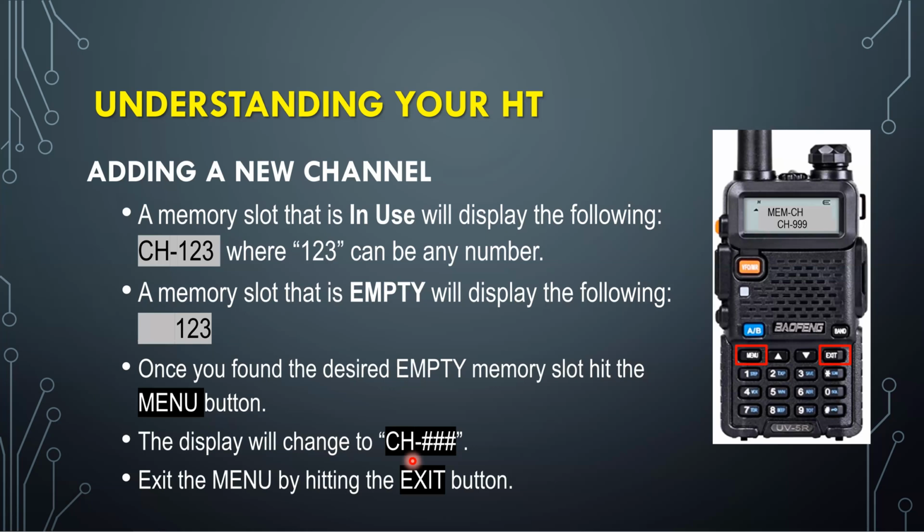Did it work? It worked. Beautiful. Programmed using channel 45. That's going to mess with your brain in a little while, but just know that Draper is channel 45. So then, by changing from VFO mode to channel mode, I can hit 45 and it'll take it directly there. 045. Yeah. When you click on exit, it takes you back to VFO mode, so be aware of that.